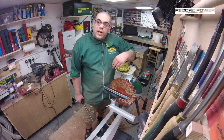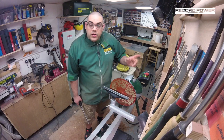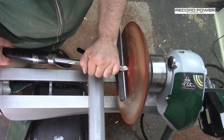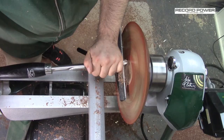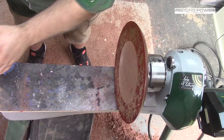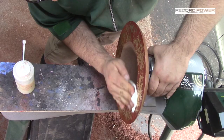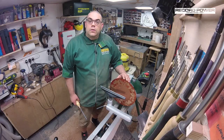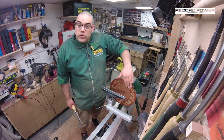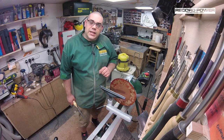What we need to do now is hollow out the bowl — I've marked out a line with a pencil of where I want to take it. So I want to take it from here and cover it in. Once we've done that we'll sand it and apply a good coat of wax to the whole thing. So that's the bowl hollowed out and it's been sanded, sanding sealer and sanding paste as well just to bring it up to that real good shine. I've also applied sanding sealer over the gold leaf too. Just before applying the wax I'm going to add a final little step — just to add a ring on the outside and on the inside — and I'm going to use this pointy carbide tool for that.